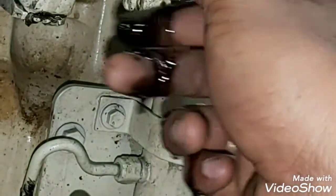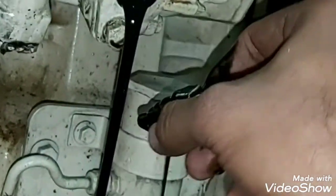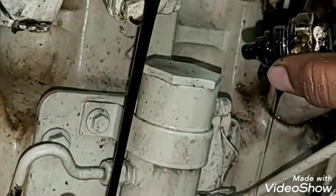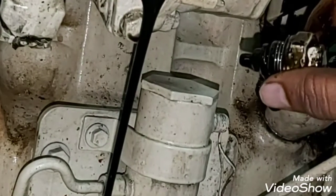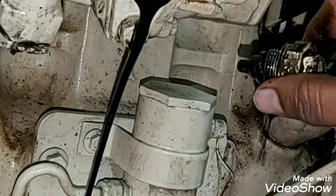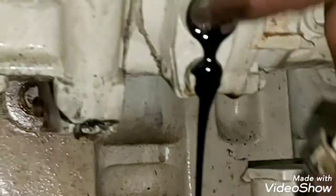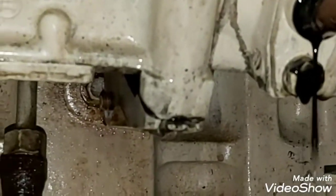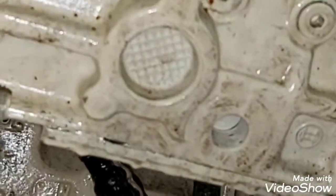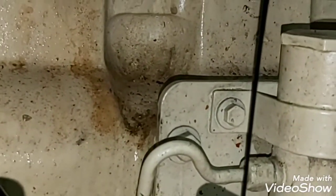A lot of oil has come out from the plug. Just make sure you keep a tray below. You have to keep your workspace clean. Inside the plug you can see one special plastic tool with a slot in it — that will go in the shaft of the injection pump.